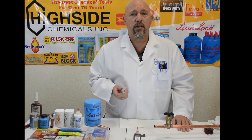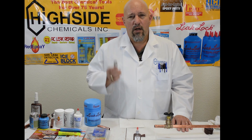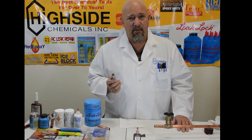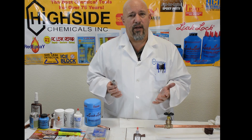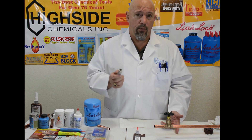Aluminum is a great product. The melting point on aluminum is about 1,200 degrees. The lowest temperature solder that I know of is about 750. So in the field, trying to decipher between 750 degrees and 1,200 to 1,400 degrees is not very easy. So you get a lot of blowout with aluminum, and most people will have real trouble working with it.